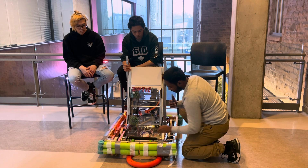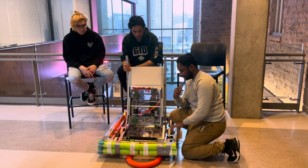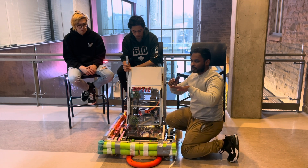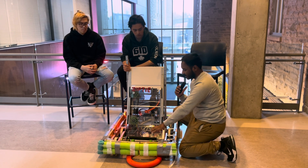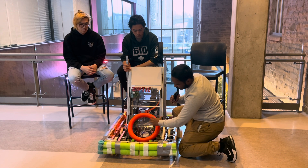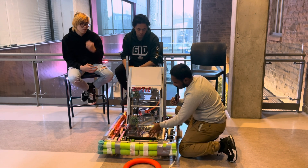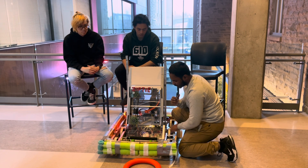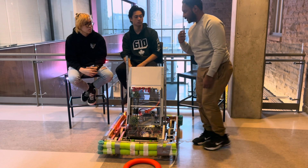The note comes under the bumper and gets picked up by these wheels. We had issues with too much compression on the intake, so we removed the center wheels, allowing the note to flex — the inner area of the note comes through much more easily. The two tracks race along the outer edges, allowing smooth intake. We also found a dead zone in this area, so we quickly added a second roller using shoulder bolts on a churro, and from there it feeds into our conveyor system.